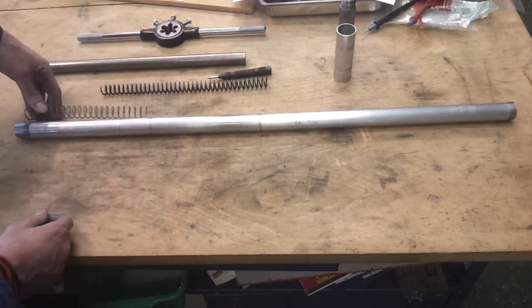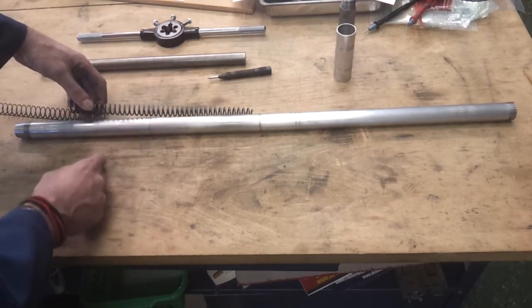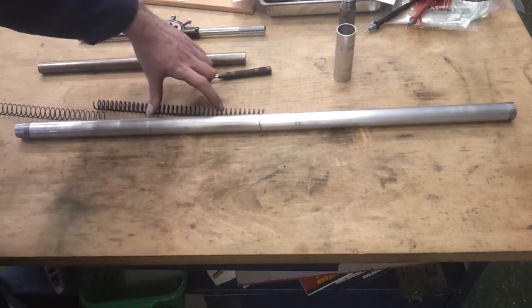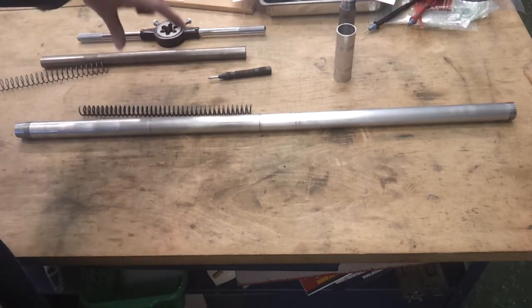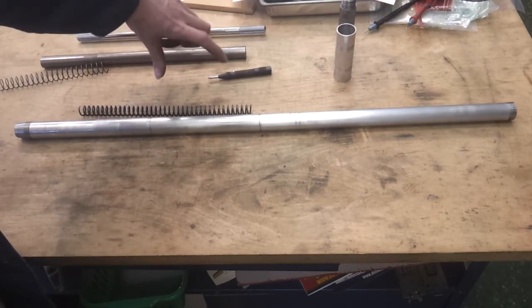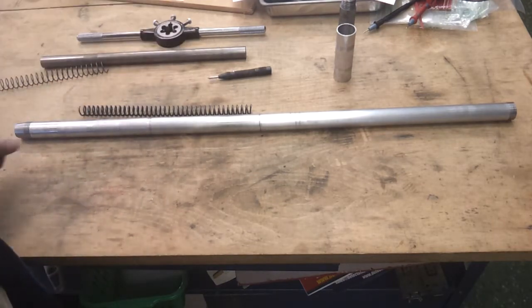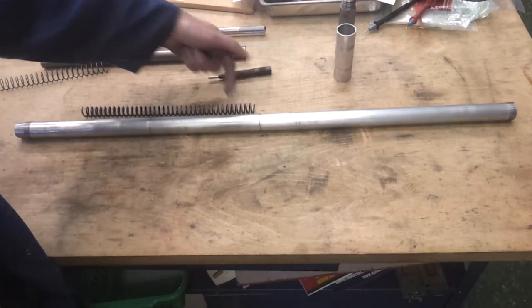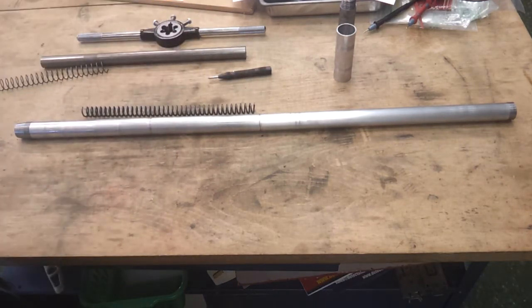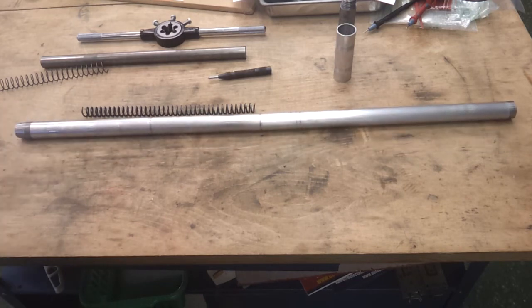I've just got to crop this down a little bit to fit in here, and then crop this down a little bit to fit in here. I'm deliberately making the firing section a bit longer than I need to begin with, because that basically means I need less force to set this thing off. I can always shorten it to put more force in, but I can't lengthen it once I've done that. So I'll start with this fairly long and if necessary trim this down and trim the spring down to increase the amount of force. So far so good - it's starting to look like a useful tool.